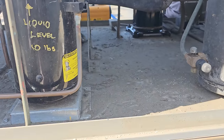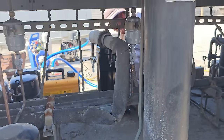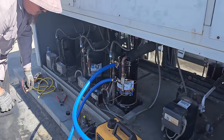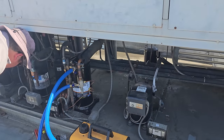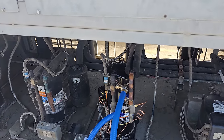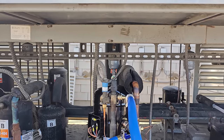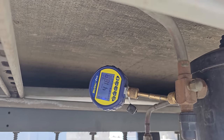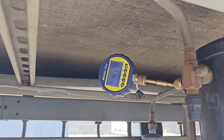We've got a new Sporlan catch-all right here with the sight glass — it's flare installed, 16 cubic inch. All the information you want is on the side. That Sporlan catch-all should help catch anything in the system. We picked up a funny smell on the refrigerant — we didn't do an acid test but that catch-all standard version is perfect for acid. They also make an HH version with high wax removal if you have issues with wax. We'll monitor it, but everything's looking good so far.